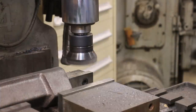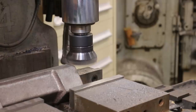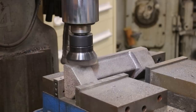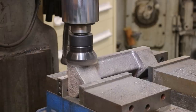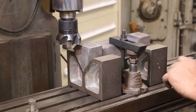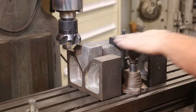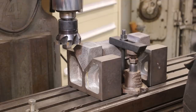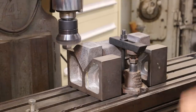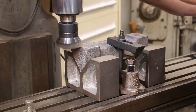We're mostly cleaned up. I'm going to take another probably 30 or 40 thou off of it. Now I want to mill the 45s on the bottom. To do that, I've got some 90-degree angle blocks in here and we've just got everything clamped down on that. We've just got to mill the ends here, so I've got it clamped down in the center. We'll have to kind of move the table around it, but I think we can do that just fine. Get them on the same level and we'll clean everything else up when we get over on the grinder. It hasn't got to be just perfect, but we want to get it as close as we can.